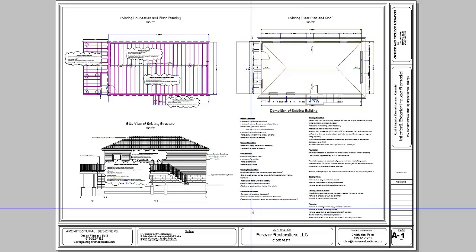The foundation appears to be in good shape. It looks like the house was lifted at one point with a small concrete wall footing, and then a block wall placed on it. So if there's anything there, it's a decent foundation to build upon.